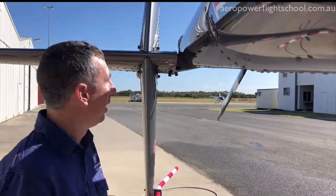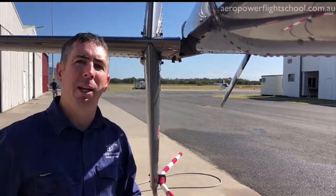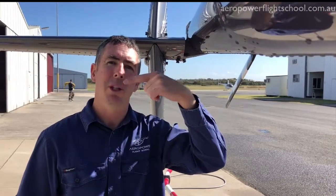As we move forward in flight and we have the airflow coming back past the helicopter, as it passes the fin, it's actually deflected slightly and we end up getting a force at the back of the helicopter from the tail fin pushing the tail this way. That basically offsets the torque effect of the main rotor.